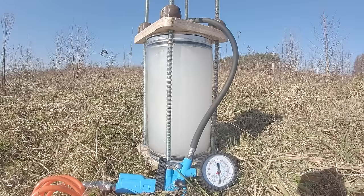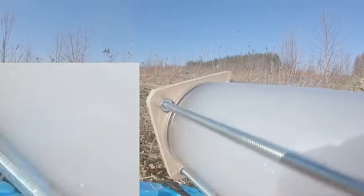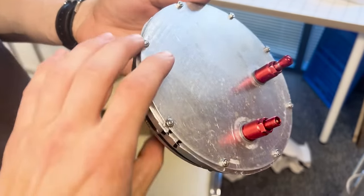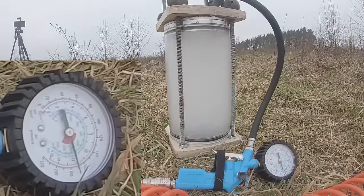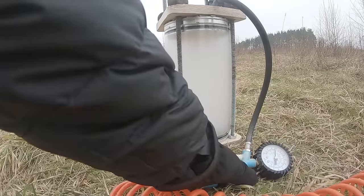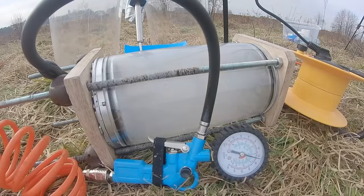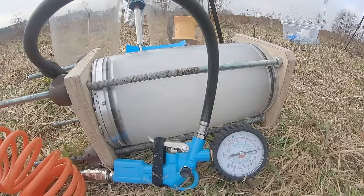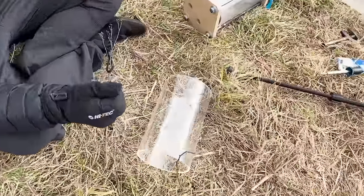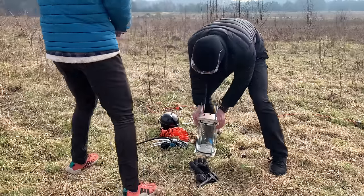Well, it didn't explode on the first try. It went to about 12 bar, and then the O-ring popped out. We really wanted to make the acrylic break, so we temporarily screwed those aluminum parts together and went back. This time, nothing happened at all. It was actually the compressor which started leaking. Then we even tried propping a soldering iron against the acrylic to make a hole at a large pressure, but that didn't do it either. It just punctured. We had literally only one thing left, and it's this. Oh! Here. Yeah. And this way, the acrylic is hopefully the weakest link.